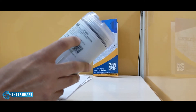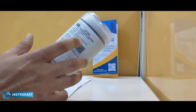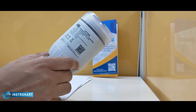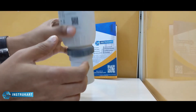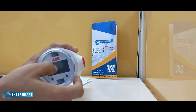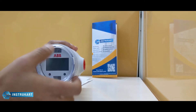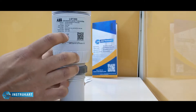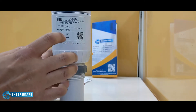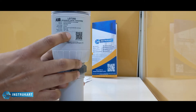The series is LST, and this has an accuracy of plus or minus 3 mm for water measurement. It has to be mounted as shown, and the display is located here. The working temperature for the liquid or medium being used can be between minus 30 to plus 60 degrees Celsius.